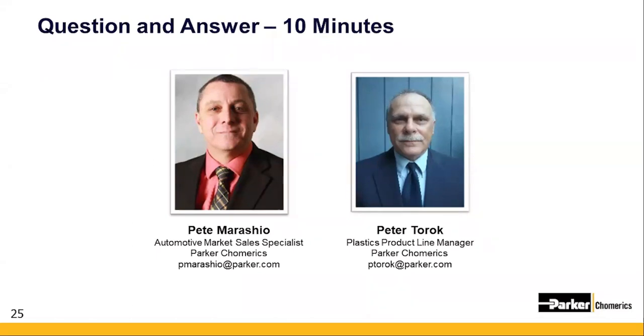So Brian, there's a question on EMI shielding gasket material. Yes, we have a question regarding the Co-Shield 2056, the silver, copper, and silver blend acrylic, and how well it would galvanically match up to the nickel graphite filled S6305. The systems are relatively close for galvanic corrosion concerns. For corrosion to take place, you have to also have an electrolyte present, such as water or salt water. If the seal is performed and designed properly without the exposure to the electrolyte, even materials like these won't suffer any corrosion. Good question.